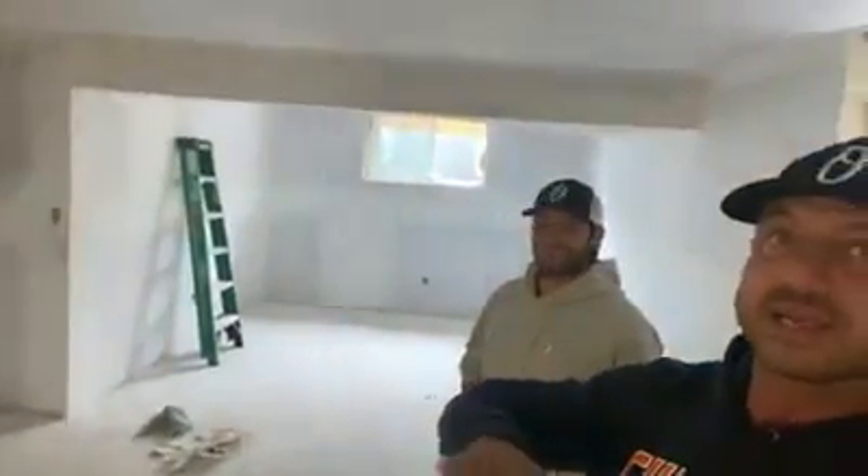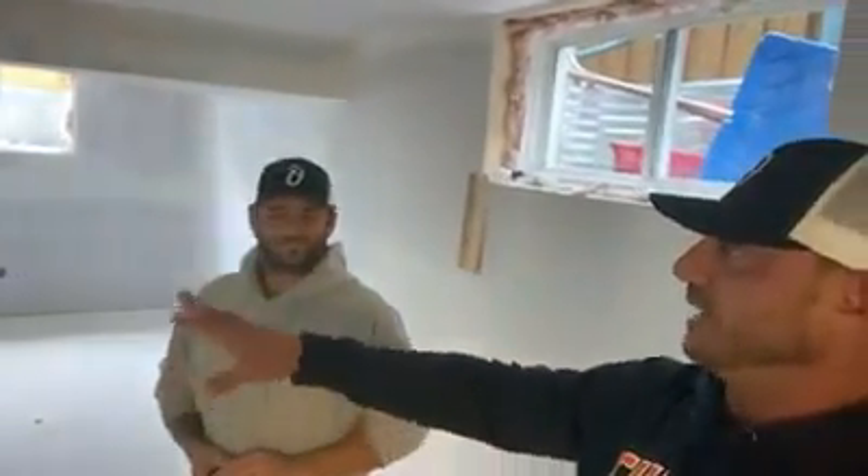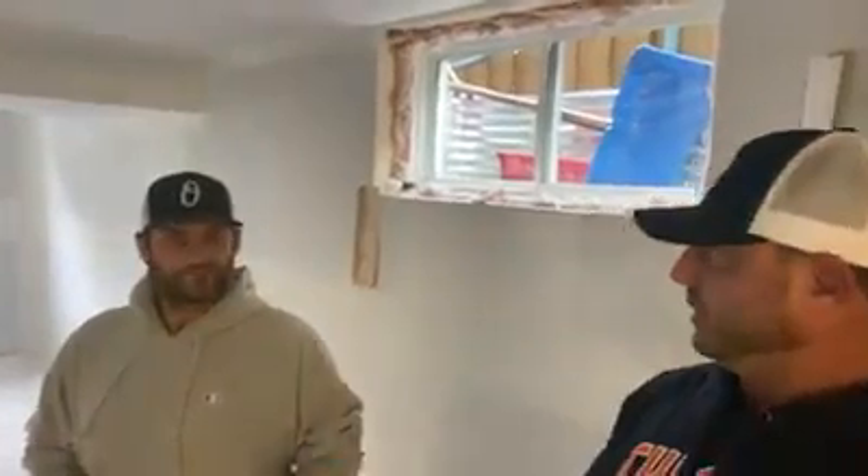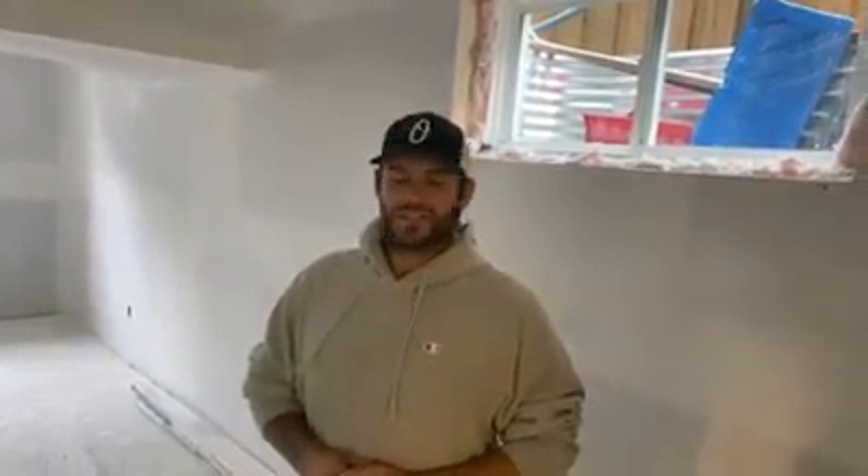Right now, as we can see, it's all been cut, taped, and sanded. We first started off with removing any of the items that were in the basement first. So when we came in the basement, they had bad insulation nailed to the walls, so we stripped all that off. We installed 2x4 framing and spray foam. We also trenched the floor to add a washroom, which is over there. And then we added an electrical room and some storage areas.